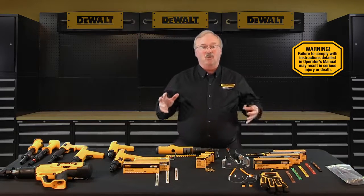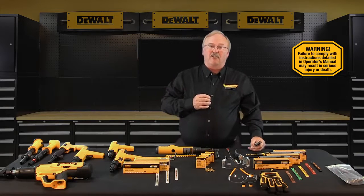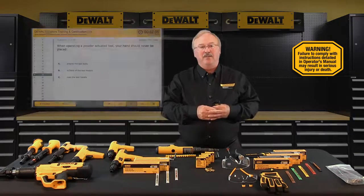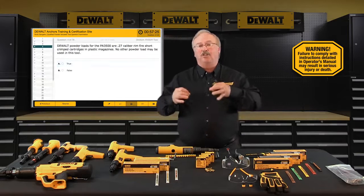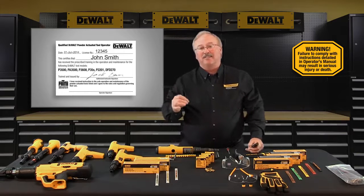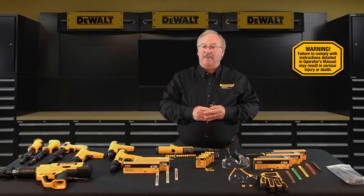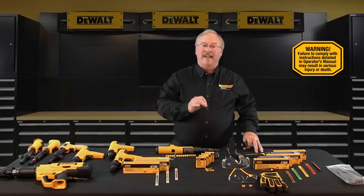Because they're ballistic tools, they can only be used by properly trained and licensed operators. To become a DeWalt Fasteners powder actuated tool operator, you must complete the DeWalt Fasteners Engineered by Powers training program — that's what this video is designed to do. You must satisfactorily complete a short operator exam and answer a few questions specific to the DeWalt powder tool you intend to use. You must also obtain a DeWalt Fasteners Engineered by Powers certified operator's license card before handling, loading, or operating any powder actuated tool. That operator's license card must be on your person any time you're using the tool.